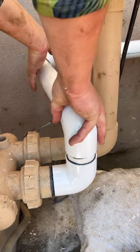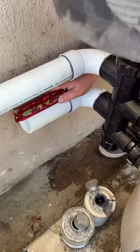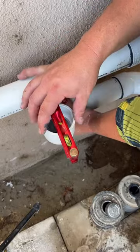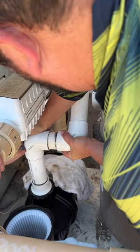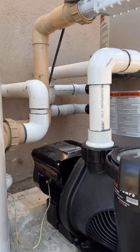I think it came out pretty clean. It was just such a tight fit. Always remember, if the customer has a hard time getting to the screen, the Aquastar does come with an app, so they can use their phone or smart device. I really like the way this job came out. The only thing I do not like is I double-90'd on the discharge side right here — it just makes me go ugh. But it does look clean though.